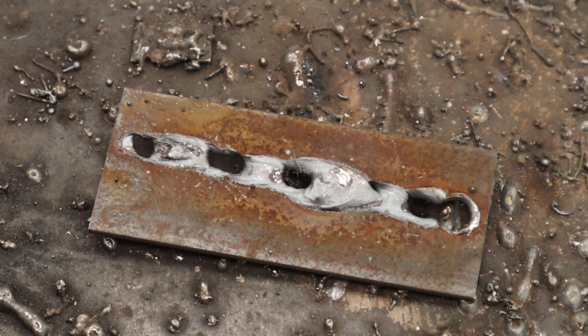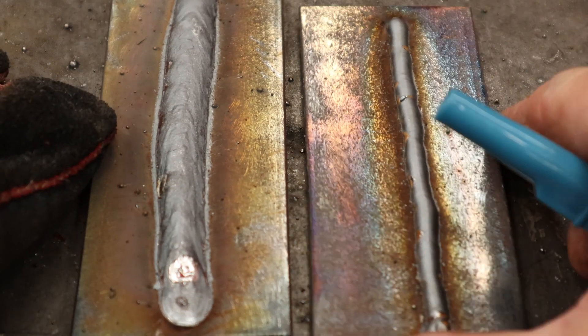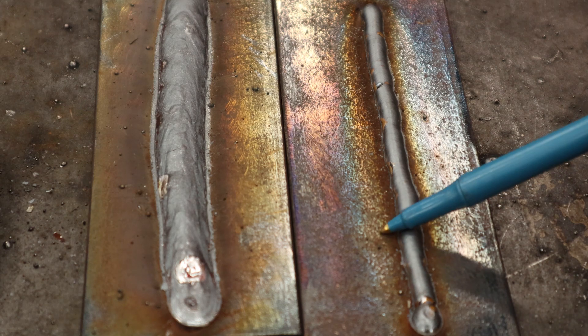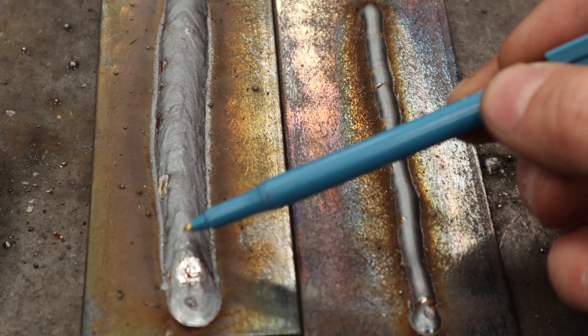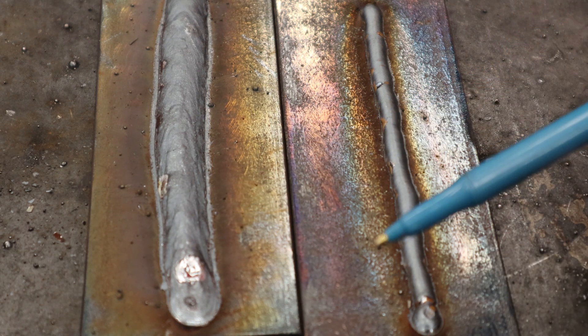You may not want your weld bead to penetrate so deeply that it goes right through the material and starts popping holes — you especially see this on sheet metal. If we compare this to the cold sample, you can see the difference: cold — not enough heat to even melt the puddle to the base material. And this hot one — so much heat that it's flattening out and penetrating through into the base material, but maybe too much.